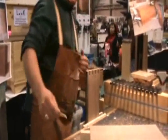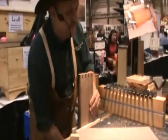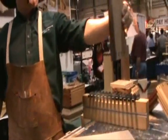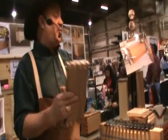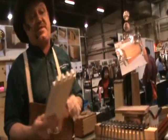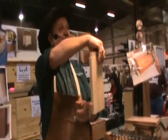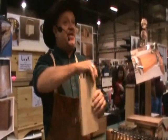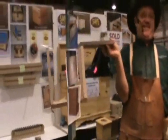And I'm going to mark this side so we know what side I just did. And there, my friend, is your perfectly spaced dovetails. Now I have to be honest with you, the tailboard is the easiest. Why? Well, it doesn't matter which way you turn it to do the other side. A tail looks the same either way. But the pin board actually does matter the way you turn it. When you get done with one side and you want to do the other, you're just going to spin it sideways, just like that. Because if you flip it, when you go to put your box together, it's going to look like this. Not that I've ever done that.